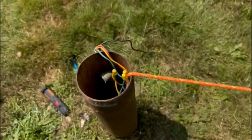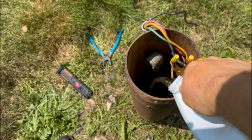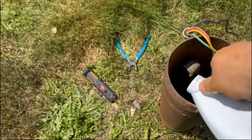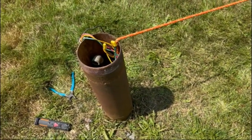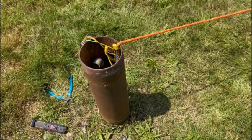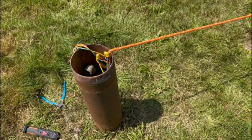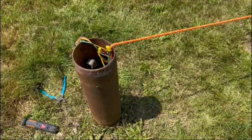I got some bleach. You know, I've had this thing out on the ground and have my hands all over it, so I'm gonna dump some of that down the well. I'm gonna turn on the outside spigot here, let the water run for a while, let it purge itself out. Now instead of drawing all that power to start the pump and drawing 8 amps of running amps, I'm just drawing 5 amps flat. I like it.